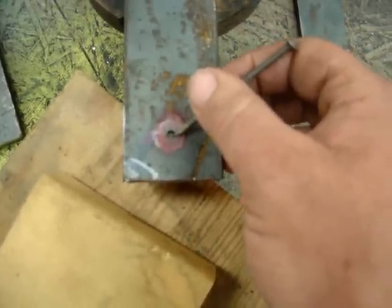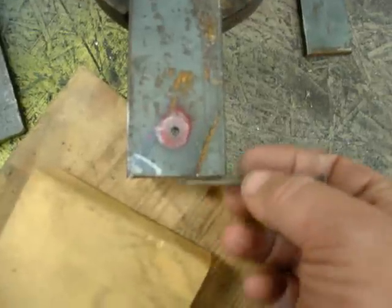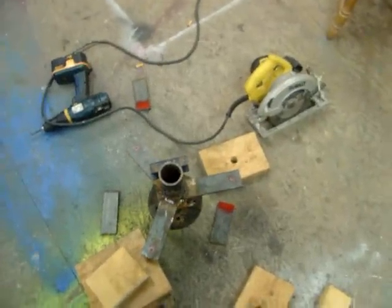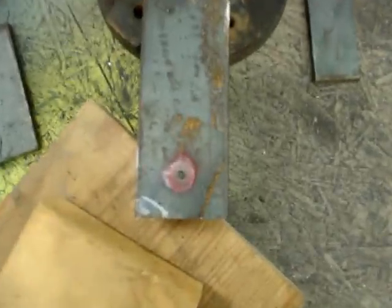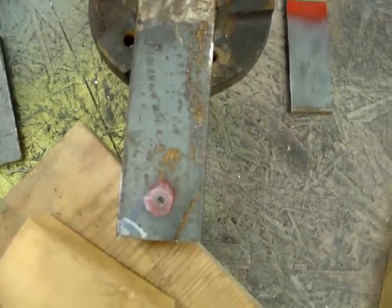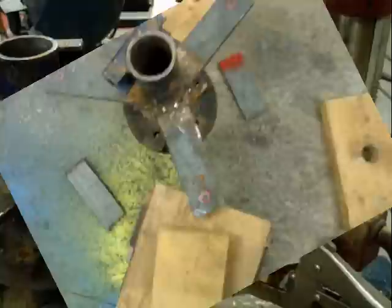I've already drilled this with a smaller drill bit, and the other drill bit will come out to about here. For cutting the steel, you need one of these blades. You really don't need a bunch of fancy tools to do this. But I do suggest, if you have a drill press, go ahead and drill this hole to its width with the drill press — to help keep the all-threads straight, and that helps keep your stator dead center where it needs to be.